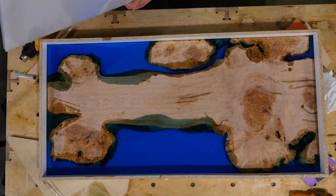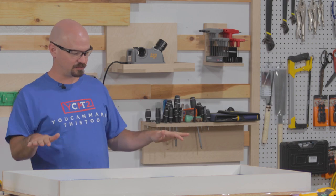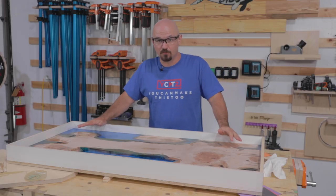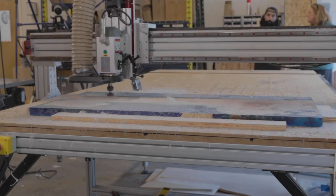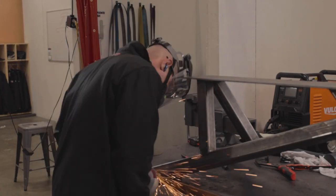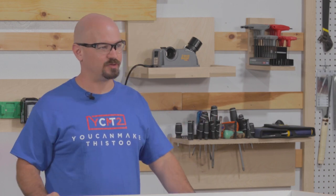We have yet another epoxy reveal. The tabletop epoxy has cured and filled in that little bit of sunkenness we had — I should have domed it just a little bit — but it also did go slightly exo on the big area, so everything worked out great. Next we'll de-mold this, throw it on the CNC and do a very light skim pass to remove the tabletop epoxy, then square it up, sand, and put some finish on it. For the base, we're going to hit it with a torch to pull all the moisture out, then wipe paste wax on it so it melts in — a fast, light-duty finish perfect for a coffee table.